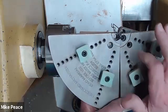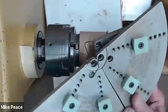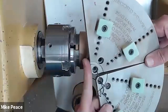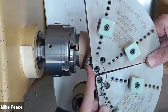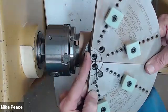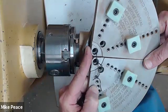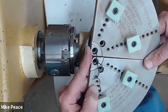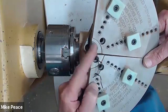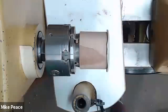You can also use these plates to put wooden jaws on. So that's another justification. The one thing you want to keep in mind, and it says on here, maximum RPM 600. This is a finishing chucking mechanism, just to finish the bare bones. You're going to have tailstock support for as long as possible on most of these methods, and then you pull it away to get rid of the nub, for sanding, and maybe adding a little texturing.